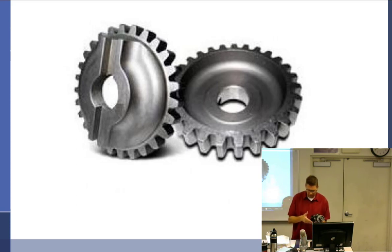Yeah. And the way you can tell is, not the best picture, but there's a lot of space right here. And these look really nice in this picture, even though the picture is a poor resolution photo. These look real nice. But the real ones almost look like they were cut with a dull rock sometimes. And you think, well, that just looks like really crappy workmanship. Hey, that's the real one. Then you look at this one, and it's like, wow, that's really nice. Except there's hardly any room right here on this edge. And this one's actually dirty. It's been used and in production. It came out of somebody's engine. But that's a bogus gear. And so there's an airworthiness directive about this company selling these things, and it's still out there.